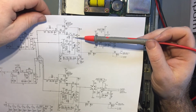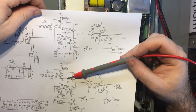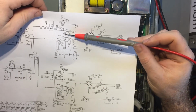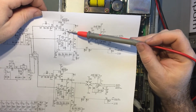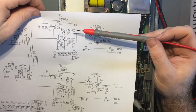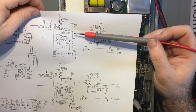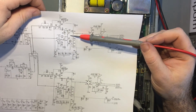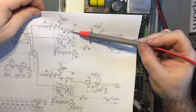So something is not working right. That one passes straight through. That one passes straight through, all goes through a capacitor. I'm guessing that is when it's monitoring channel C. I guess that shunts that down. So that is just a guess. So that DC offset, if it's not coming through here, it must be coming through here.